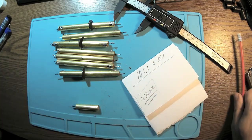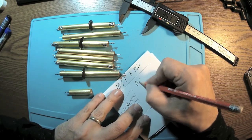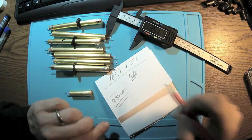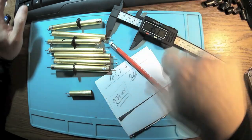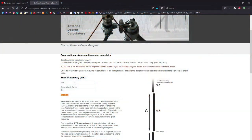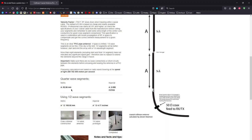I'm not sure what that short segment is about, but anyway, let's consider the velocity factor of this coax is 0.66. We found the first tuning frequency was 934 MHz. Using the coaxial collinear antenna calculator with a velocity factor of 0.66, let's punch in 934 MHz and calculate. We get a half-wave segment of 105.92 millimeters — very clear.